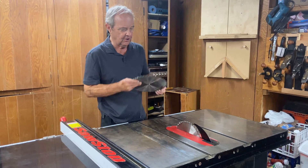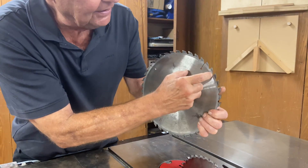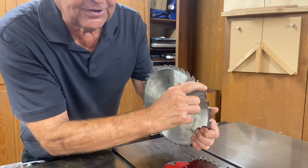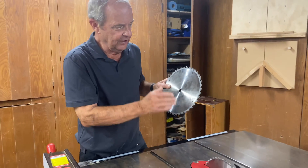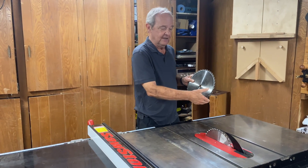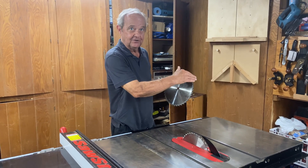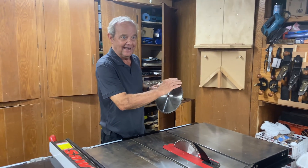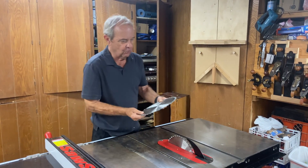Take a look at this saw blade — you can see that the back of the tooth area is rounded, and the front of this carbide blade has a sharp carbide tip on it. If you're ever in doubt as to which is the sharp side, run your hand across it very lightly. Going one direction there's very little friction; going the other way it almost hurts to push your hand against it — that's what you want to be doing to the wood.